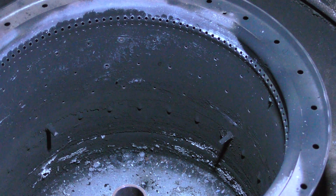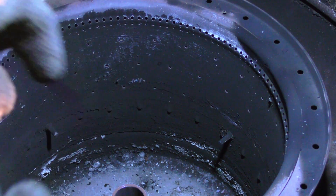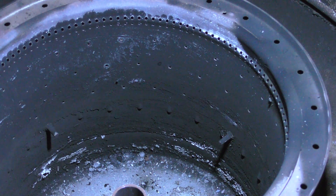Using science and magic they've obviously worked out that that's the best way to aerate the burn going on inside. Mine's got a bit of a swirl because of the way the fan blows, but essentially it's just the same as a Thermobile where it pushes the air on top of what's burning to vaporise it. It's really quite efficient, though it could do with a hoover in there. You have to clean it all the time because waste oil is full of carbon and whatnot - the oil burns off but the carbon stays.